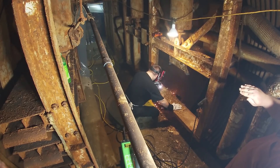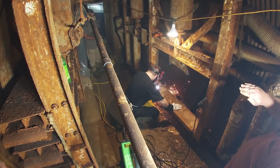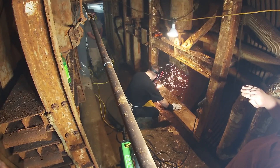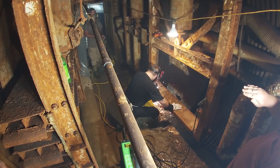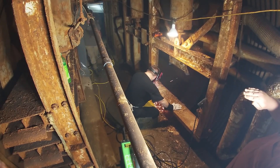Biggest downside to plasma cutting is the slag that it leaves behind. Sometimes when you make a cut on two ends of a beam, you'll have to come back and find out where the slag sealed the beam back — just bead on it. You'll see that in just a minute here. These are some of the first cuts we did inside the silo, so it was new to us.